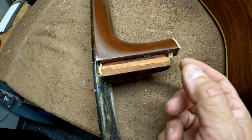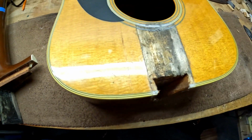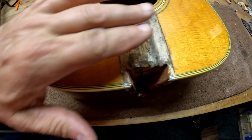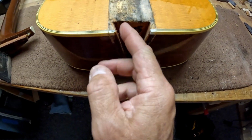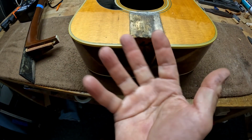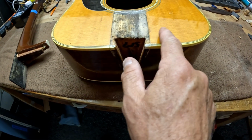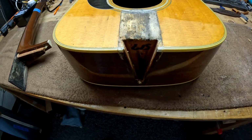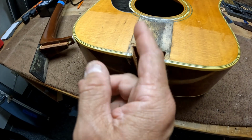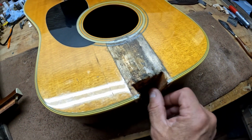Had I used steam, the steam would blow up. In fact, the problem with steam that people don't like is it'll blow steam out here on the side sometimes, and it'll blow out right here and cause blushing. That's why people don't like steam. However, that same disadvantage also brings the heat up in here, and had I been using steam, I would have had a lot less trouble here.